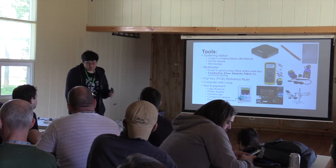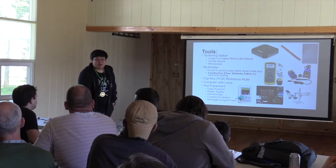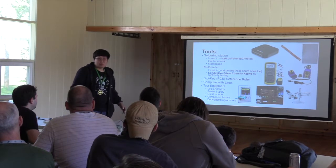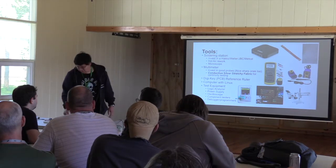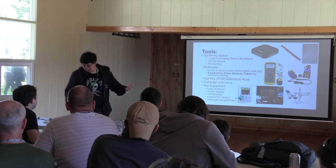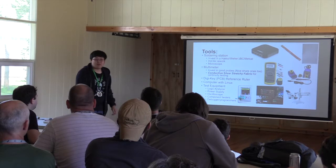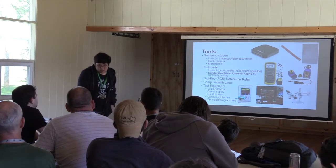This has saved me quite a few times because there are weird packages, like 6-pin SOIC packages that will have dual transistors in them. Initially you'll think, oh, it looks like a typical analog integrated circuit, maybe an op-amp or something. But you look up the part number, and there's nothing remotely close to an op-amp there. So if you hook up three of the leads of that 6-pin SOIC, you'll find, oh, okay, there's a BJT there, or there's a MOSFET on the same die. At least in my case, it has narrowed down my search area quite significantly. Then you just look up the part code in an SMD code book, and it'll usually pop up there.